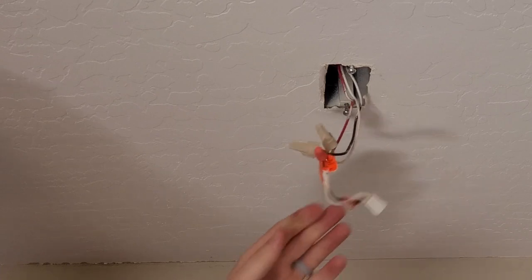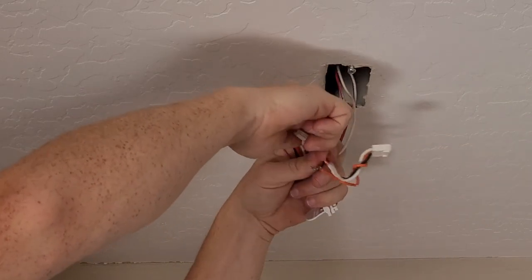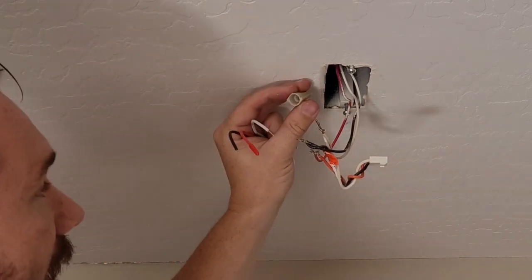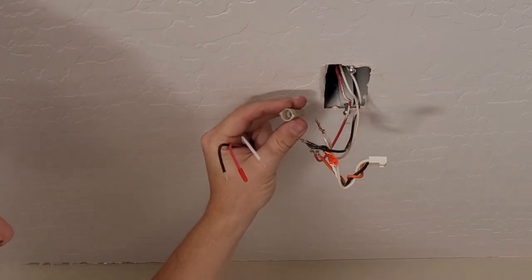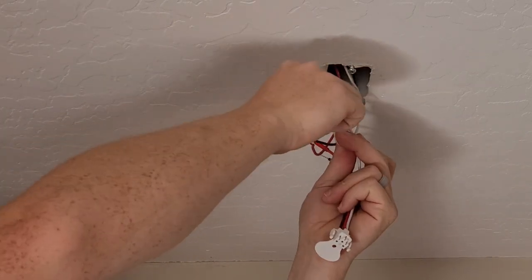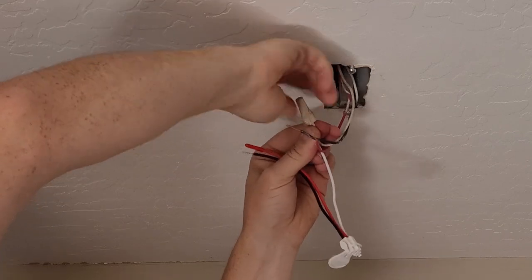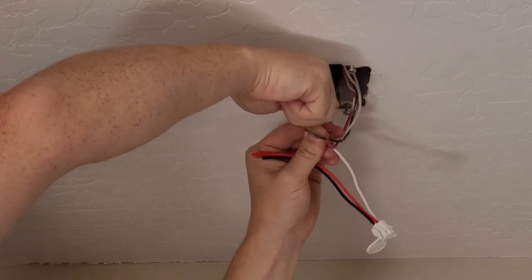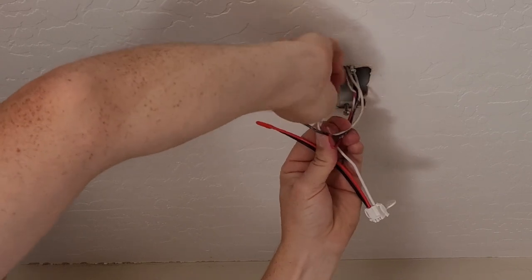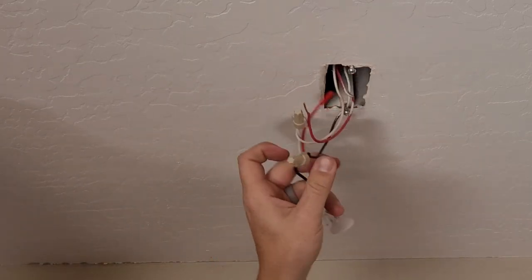Let's concentrate on our wires real quick. If your wire nuts are in good shape, you can reuse them, otherwise replace them. Look down inside your wire nut. If you see wires stuck in there, you're gonna have to replace them. If they came out clean, oftentimes you can reuse them. I'm just gonna hold the wires parallel and start our wire nut. Tighten until the insulated portion of the wires has a few twists in it. Yeah, that one looks good.